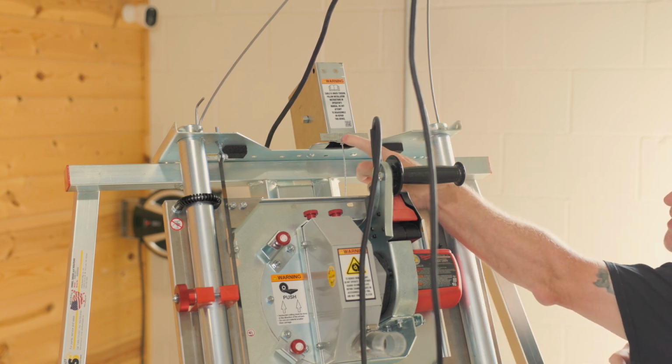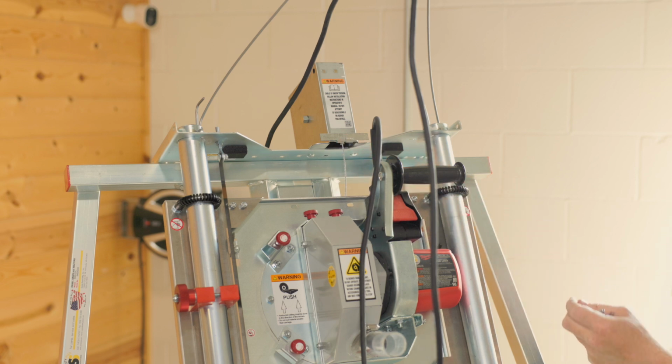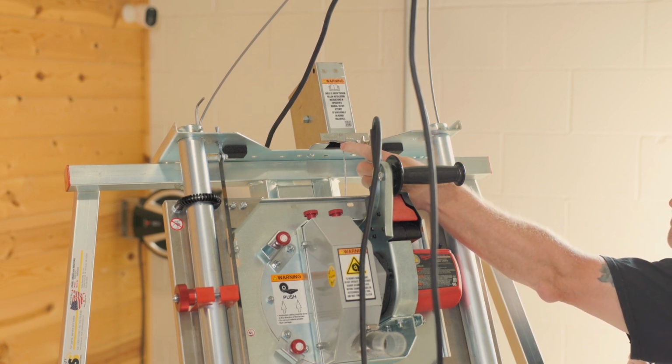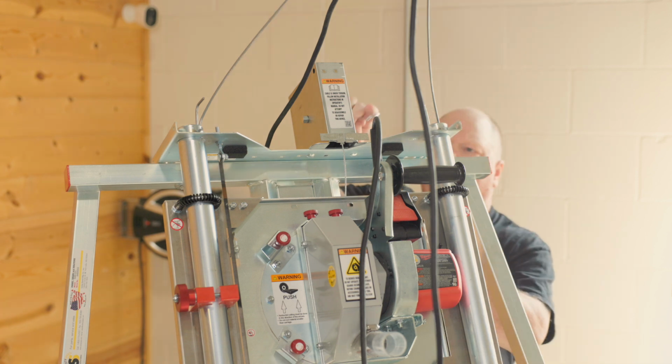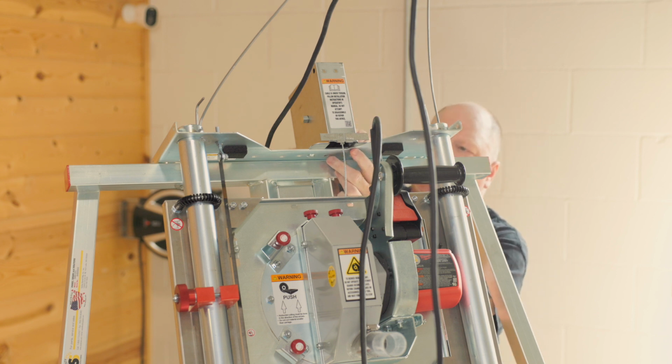Hopefully you got the retaining clip on the cable here. With an older counterbalance, it doesn't matter, you're replacing it anyway. But if you have a functional counterbalance, there's a retaining clip that usually comes with these counterbalance assemblies. It's good to hold on to them, and then if you have to, for some reason, remove it, then you can reuse that retaining clip. And then you can remove the counterbalance from the top of the machine with the 7/16.